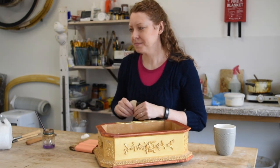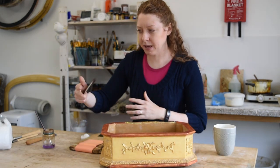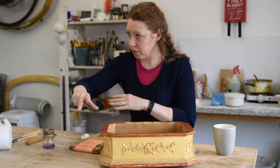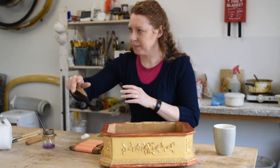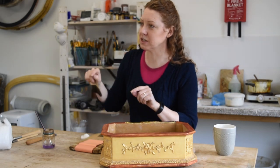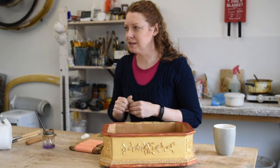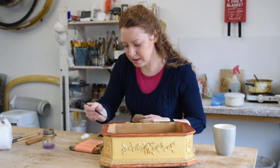So what do you sculpt to make the match? If it's a big piece, I will draw it out, flip it over, draw it out again, and make it in clay on the piece — with some cling film so it doesn't damage the frame. Mould that, take the mould off, take the clay off, and then press the composition — which the other scroll would have been made of originally — into that mould, and then attach that. I've heard this term composition before, or compo.